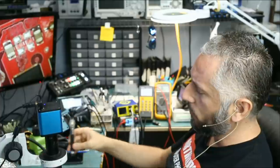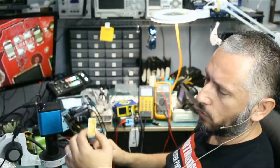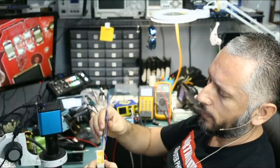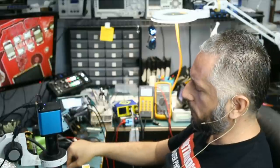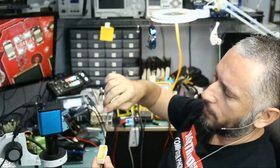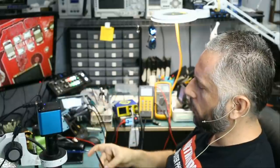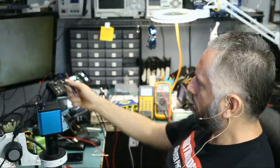The only difficult thing I found was how to break a piece of the frozen flux to put it inside the core — it's hard like a rock. I tried to break it with tweezers, but that proved difficult. So I found an easier way: I applied heat onto the flux, it got softer, and I took some off with a plastic spudger. Now I'm able to break a piece of the flux off the spudger and put it inside the core.